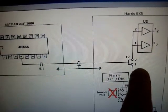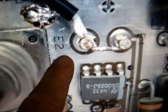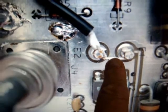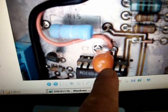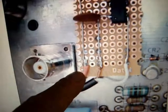Going to E2 where the jumper is — here's the cable coming down. That's the E2 jumper; it goes across it. I just soldered this shielded cable, one side there and the ground goes there. There's the five volts — that goes over to capacitor C7, and that's the five volt supply. I just tack that red wire onto the plus right there, and it goes up to the oscillator board.